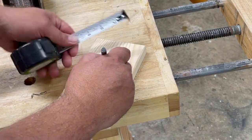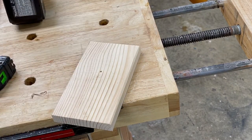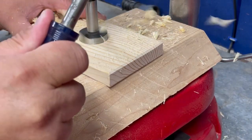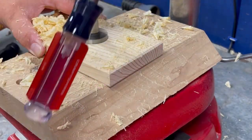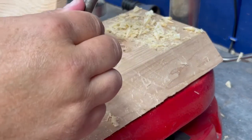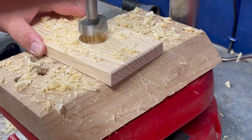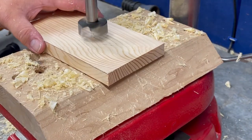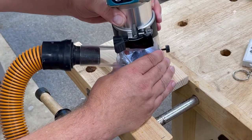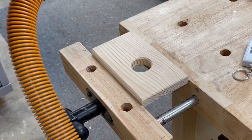Here I'm just trying to figure out where I'm going to put the hole for the birds to get in. So I use my center punch, and I'm going to use my drill press to go ahead and put the hole in. What I tried to do is go almost all the way through so you can just see the very tip of the forstner bit poking through on the other side — then it doesn't tear out quite so bad. And then you finish your hole on that side. Then I just routered around the top just to round it off a little bit. I don't know if that's good or bad for the birds, but...